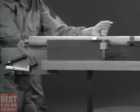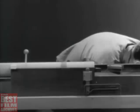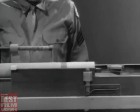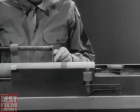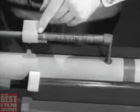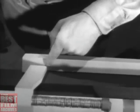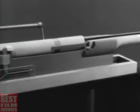The barrel extension strikes the receiver, stops, and the bolt continues to the open position. To move the barrel, barrel extension, and bolt forward, we'll again use a spring. With the bolt open, the spring is compressed. One end pushes against the bolt. The other end is braced against the receiver. When the spring expands, it first closes the bolt, then pushes the barrel and the barrel extension forward.